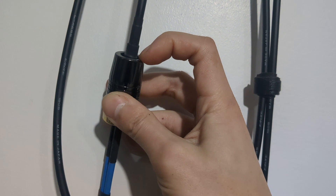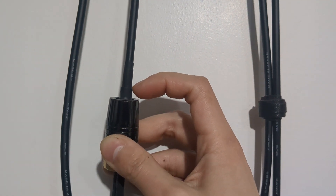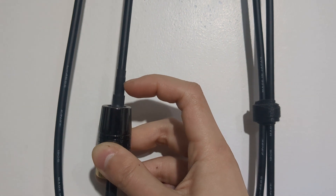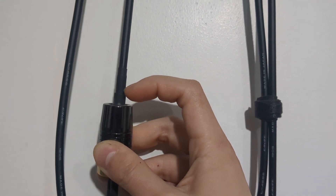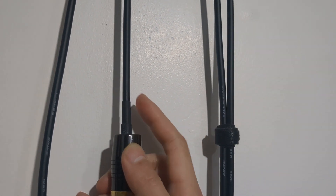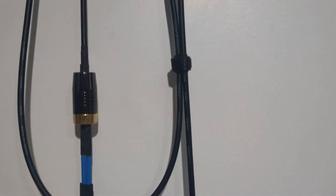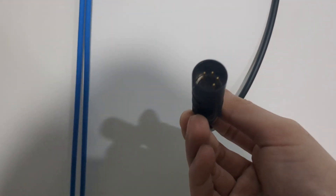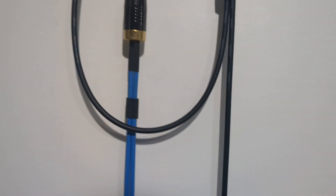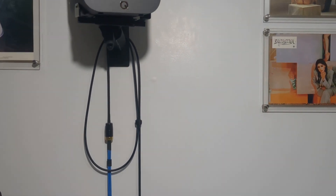Because this boot is meant for speaker wire, it's overly large for this kind of cable. What I've done is put a ton of vinyl tape around the junction point where everything is soldered together, to thicken up the cable so the barrel fits better. Then I used multiple pieces of heat shrink — a larger, a mid-sized, and a smaller piece — all overlapping, creating a gradual reduction in size down to the cable. All of that terminates into a full-sized four-pin XLR. It took me about three-quarters of a day to get all the measurements right and do all the soldering, but it's worth it.